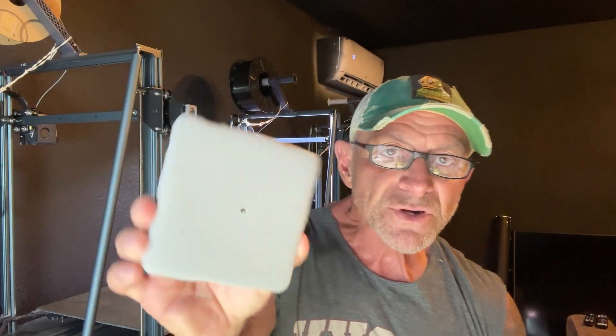So what do we do to solve that? This is a base — what those trophies go on. In the bottom of the trophy there's a hole, and there's a screw that goes in that hole up through the base into the bottom of the model and holds it. So we wanted to make the bottom of this model as strong as possible. We went from three layers typically to ten layers. We solved that issue by moving back down to three layers and just making the wall of the hole a little thicker to give the screw something to latch onto.